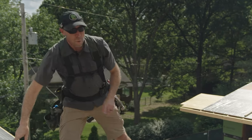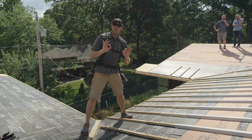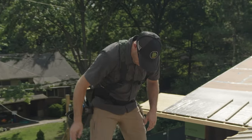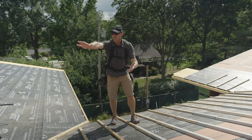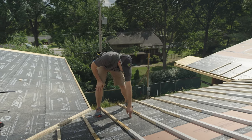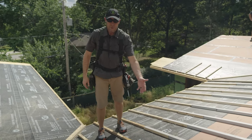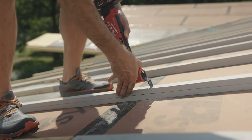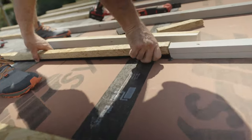Here's where the problem comes in. When you ask your framer to do 16 different things on the same house, you might only get 14 of them — which is still really really good — but I need this job done and they just missed a spot here, so we're going to fix it so they can get rolling first thing tomorrow. I want venting in at least the first two bays over from the valley so I can get some air in across that valley and vent it well. So I'm going to use an oscillating multi-tool and take an additional six feet, basically extending this an additional six feet to let air into this cavity.